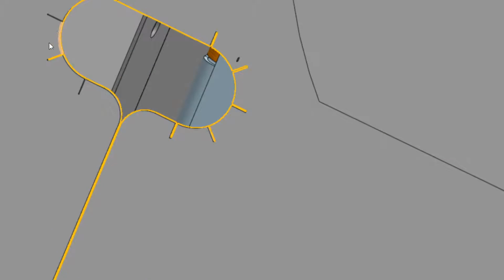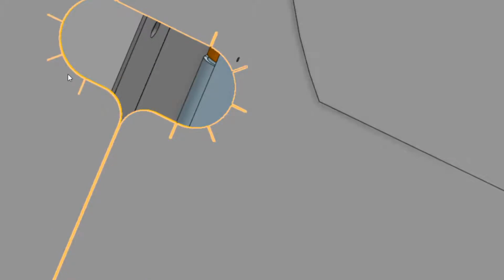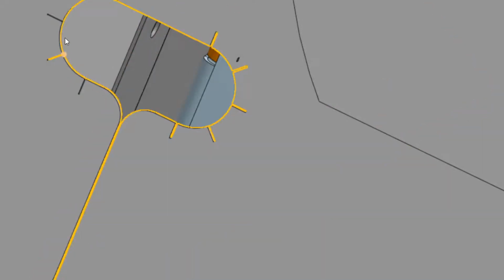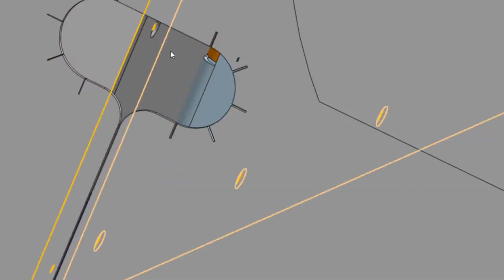But the whole idea of these little pedals is that you can bend them so that you have a smooth face of tin near that oil line. I really don't like the hard, sharp edge of this galvanized steel that's cut with a laser having any chance of making contact with the oil line.